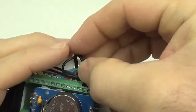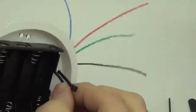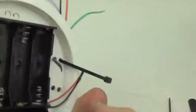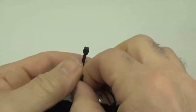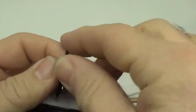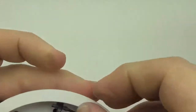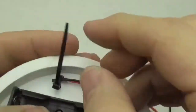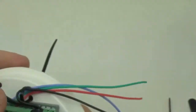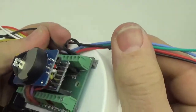you can add a bit of noise, which I do by pulsing the LED, and oversample to a very high resolution reading. It just uses a lot of power because you have to wait for all of the samples. It's a power of two relationship. Okay, so that's loose. I'm not going to tighten that down. I'm just going to leave that there until I've done my routing.